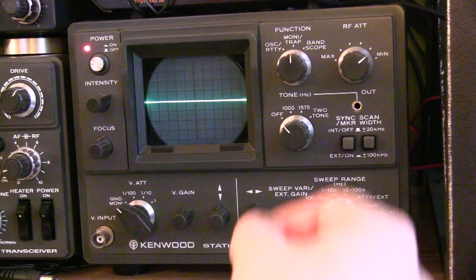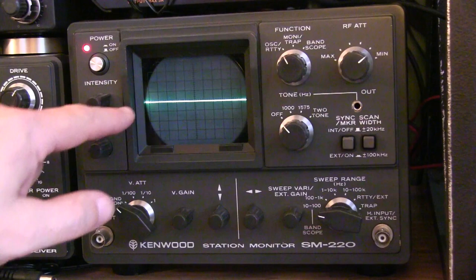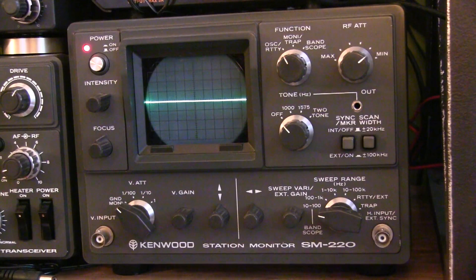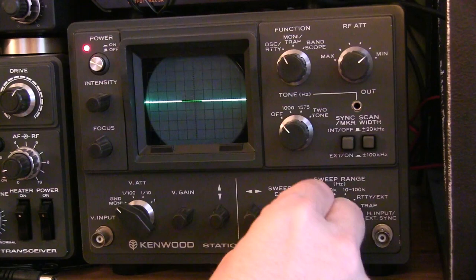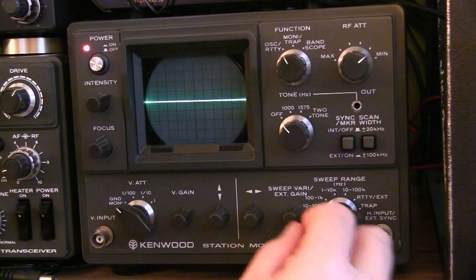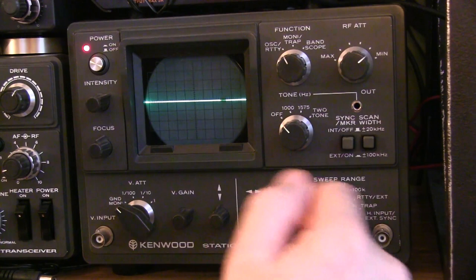Other functions include just your basic oscilloscope functionality. It's a single channel oscilloscope, and I would say it's limited in terms of what it can do because it's not calibrated — there's no calibrated vertical scale, just a variable setting for the attenuator: no attenuation, one tenth, one one-hundredth, or monitor mode. So you don't really have a voltage reference unless you apply something else yourself. On the horizontal scale, you just have a sweep range from 10 Hz up to 100 kHz, but no calibrated horizontal time scale. There's also no trigger input; it's a recurrent sweep scope that uses an injection-lock type oscillator taking synchronization from the input signal.